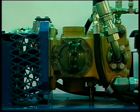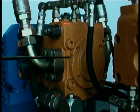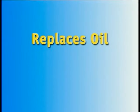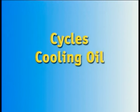As with any pump in a closed-loop system, our drive pump is equipped with a charge pump. The charge pump performs three essential functions in the hydrostatic system: it replaces oil loss due to lubrication and internal leakage, it supplies pilot oil pressure for control purposes, and it cycles cooling oil through the main pump and motor.